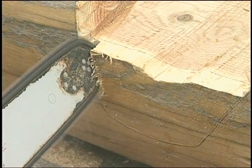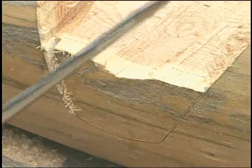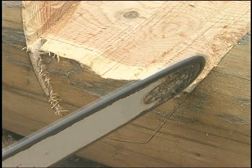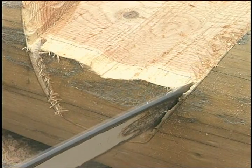The side segments can be removed with multiple saw cuts or by plunge cutting to near depth at the back, then cutting around the notch only near the line and finishing with a slightly curved chisel.